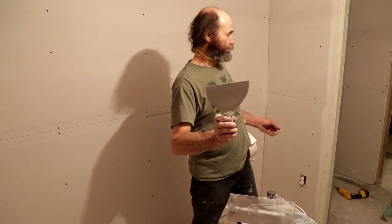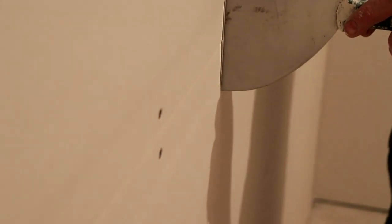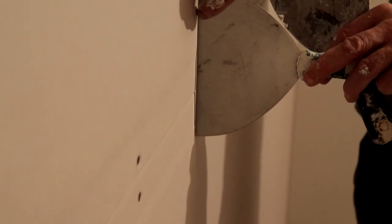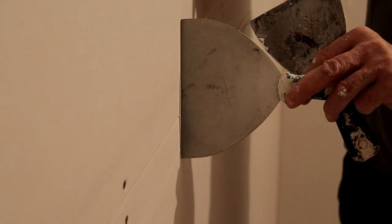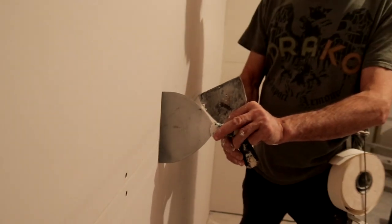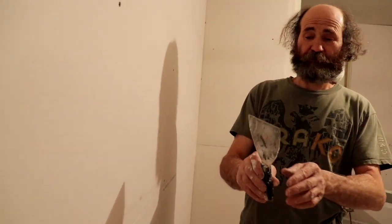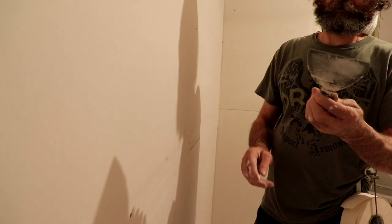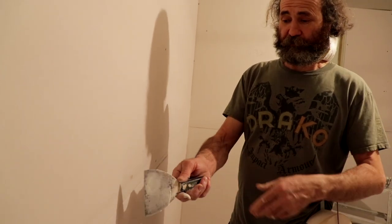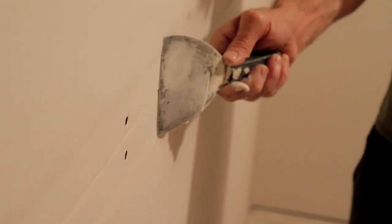The reason — I'm gonna show you guys why. Like you guys can see, the 6-inch knife is a little bit wider; I'm gonna go above the bevel and it's a little bit harder to squeeze the tape. With the 4-inch knife, this is smaller, so we have more pressure per square inch, so it would clean better.